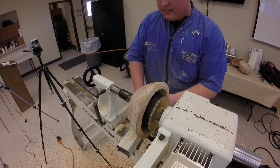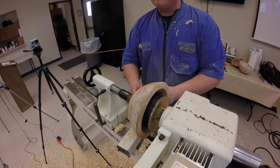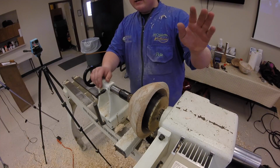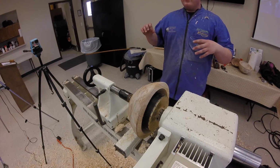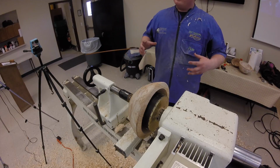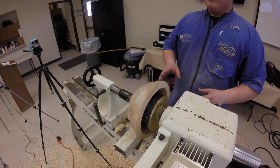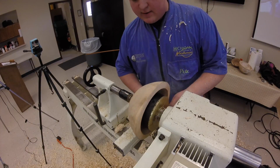I know a couple things I've tried is trying to dry the bowl with heat. So I've used my microwave, going in for about 2 minutes. Don't use the microwave in the kitchen. My parents hate me for it. The other method I did is boiling it in a really big pan over a propane tank. And I boil them for around an hour per inch of thickness. And it fries the moisture out, and then you put it out to let the air get back into it, let the moisture evaporate out. And when it's all dry, the wood is dry enough to turn.